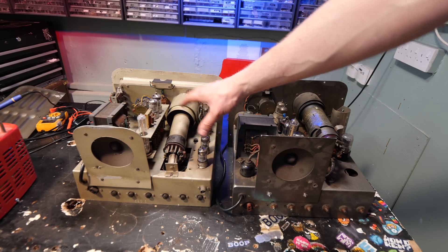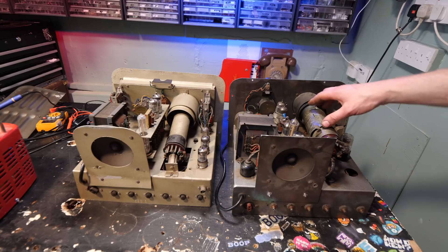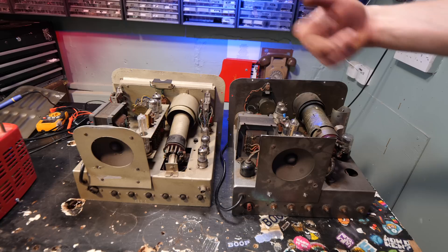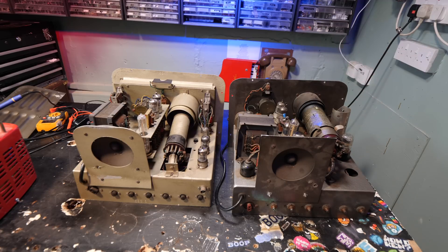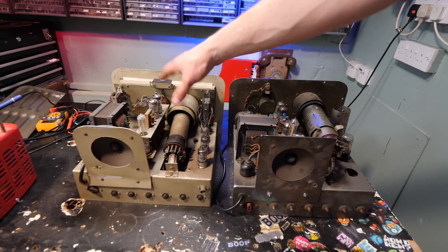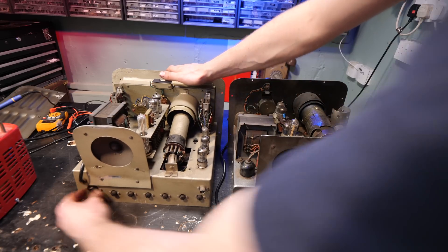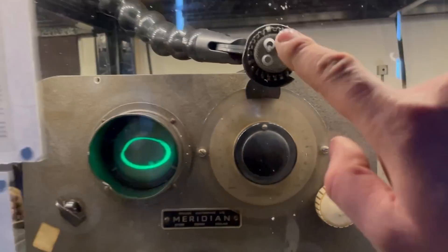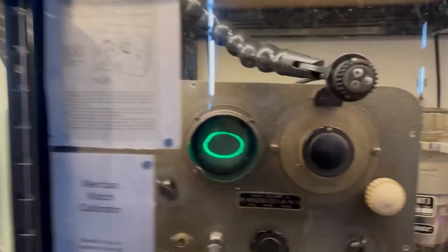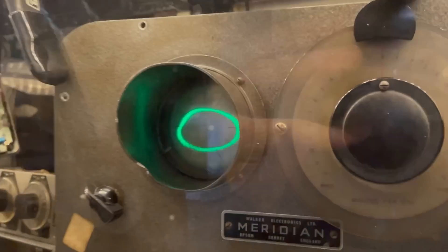I've got some parts turning up to have a go at trying to get this one going again, because as you saw it wasn't running at all. Let's see if we can get some life out of this. This one is doing something. I have a feeling the beam on the front is supposed to be a little bit more round — it might come with more time. There are a few more capacitors I need to replace. I've checked a lot of the resistors and they seem to match up with the ratings on them, so it should be quite straightforward. Hopefully in the next video this will have a more round display, and this should kick into life, and then we're going to try and repurpose them for something.